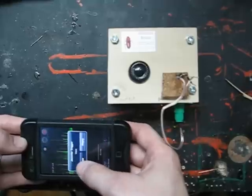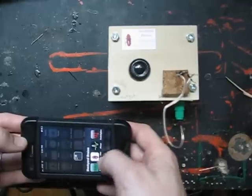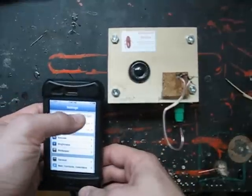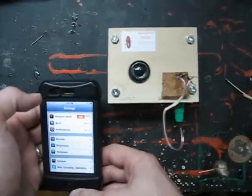There we go again! So how can you record your spikes without having all this 3G network noise interfering with the amplifier's sensitive electronics? You do what you do when you're on an airplane — you simply put it on airplane mode so that the 3G network is no longer interfering with your spiker box.